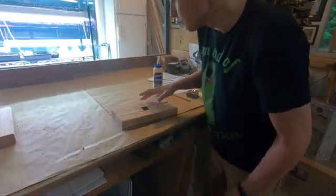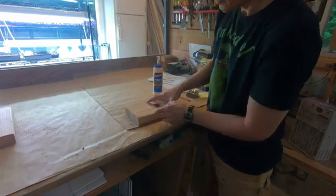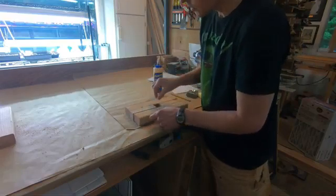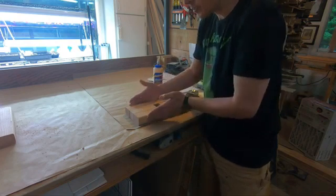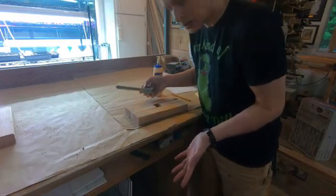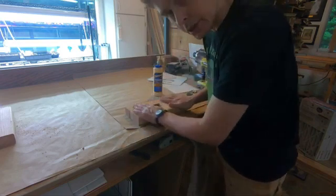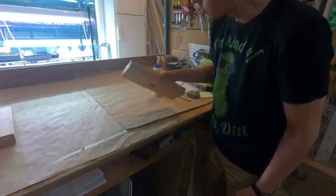So this next part that I'm working on, I'm not sure what it's called, the guide blocks, I think. I've taken just some relatively cheap 2x6s and cut them down so that I got 2-inch pieces sandwiched in with 1.5-inch pieces to basically come out with the 5.5 inches that a normal 2x6 would be. And this square opening in the middle will be just right for the plunger. So I'll go ahead and glue these together. Later on, I'll be able to sand these things smooth so that the wood will look a little nicer.